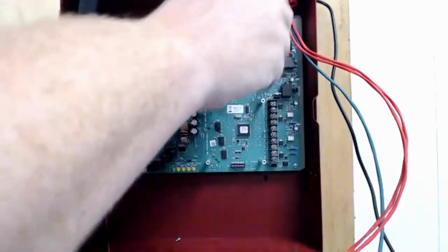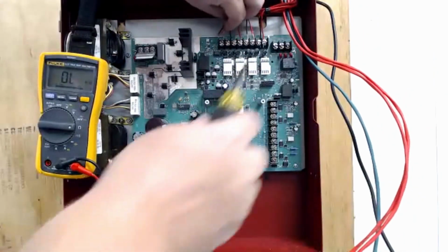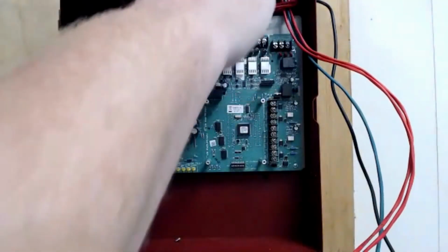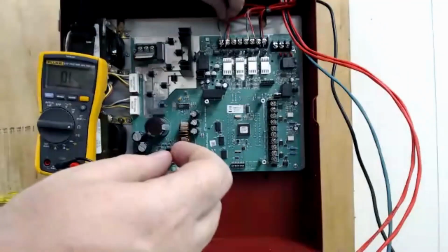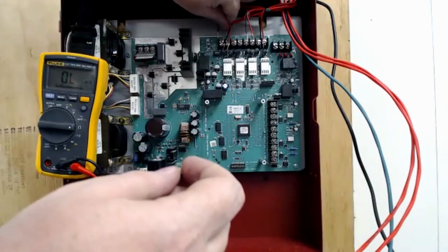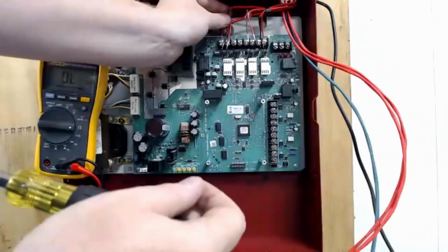Doing it this way, you already know that your circuits are going to be clear, so you're not waiting for power to come on, crossing your fingers, saying, oh, please, no problems. You're like, no, I've already done the work. Oh, I put that in the wrong one. You've already done the homework. You know that everything is good. So when it comes on, you know that it should just come on a clear panel because you checked it with your meter.